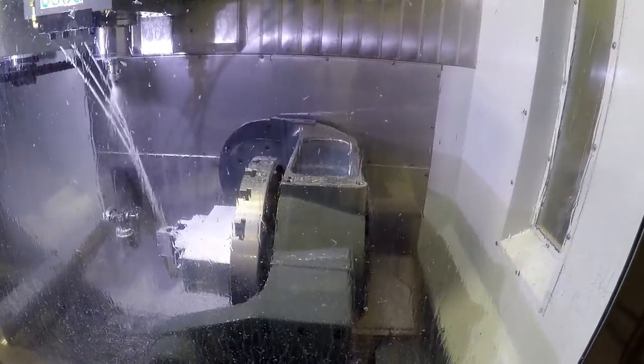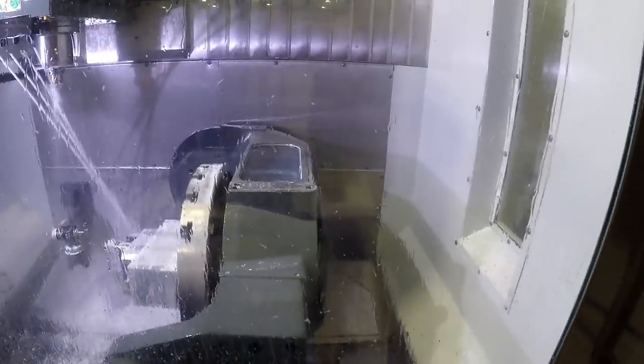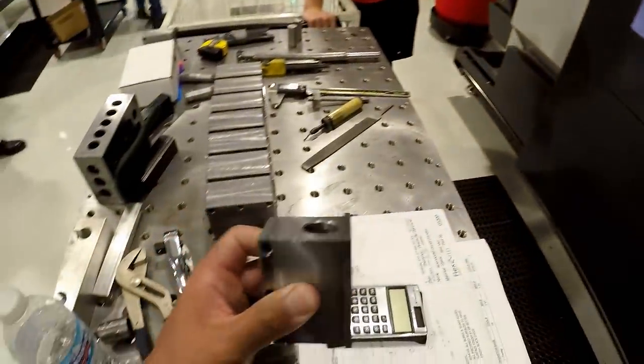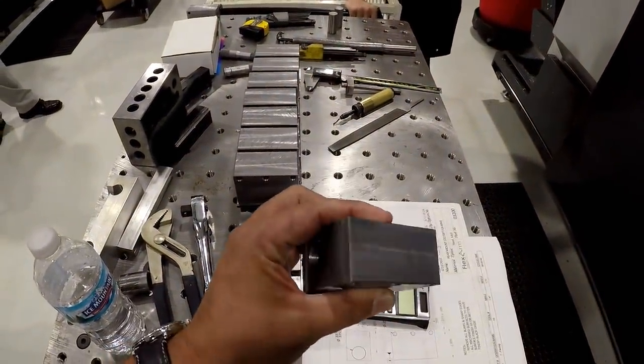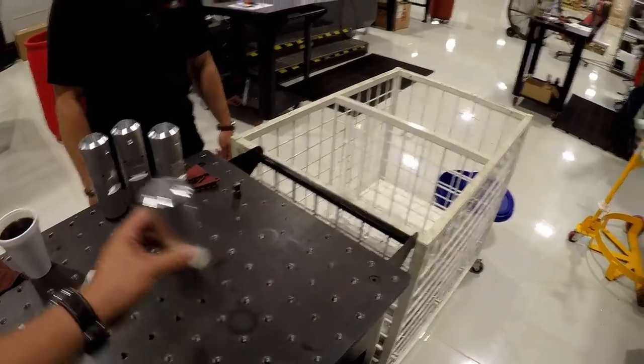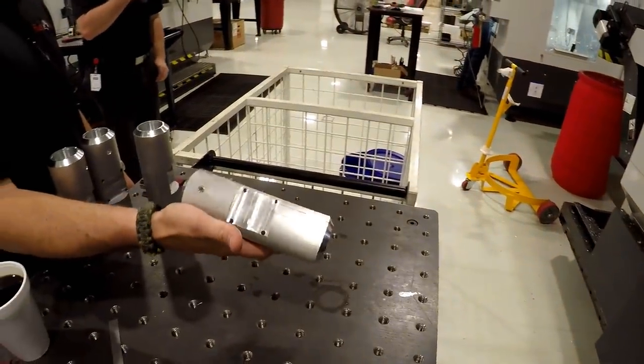Like you've been doing the chamfers there. A better look at the part that he's been machining. Is that what we're making? That's what we're making right here. Just basically running that chamfer along the top, running that bevel along the top. So this, in my world, would typically be a lathe job right here. So the five axis gives us the capability of hitting these flats on here, rotating around, basically hitting all the sides on this part that needs machined out.